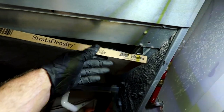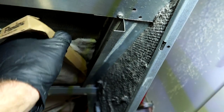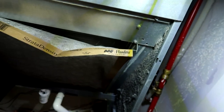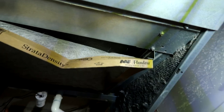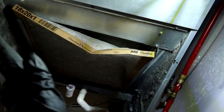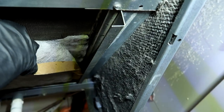You've got to wait till the ice is melted - you've got to be patient. I've worked with a lot of guys who just start dumping while the coil's covered in ice, going 'why ain't it rising?' And then it finally melts, they turn it back on, and it shuts off on the high pressure switch. Be patient, you guys - let that ice melt. Get paid by the hour out here.